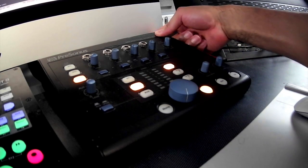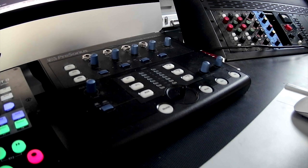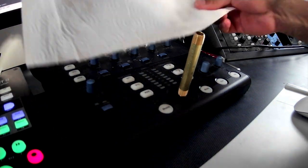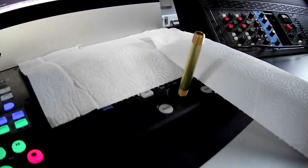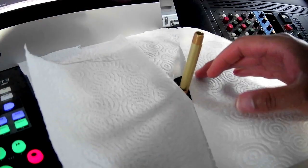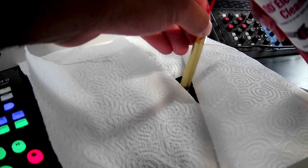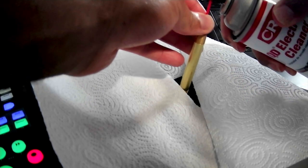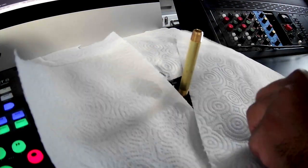The first thing we're going to do is power off the monitor station, and then I'm going to remove the volume knob. I'm going to put this pipe over the stem here, and just make sure we don't make a mess — I'm just going to lay some paper towels down here. And we'll take the electronic cleaner. Just make sure it got on there.